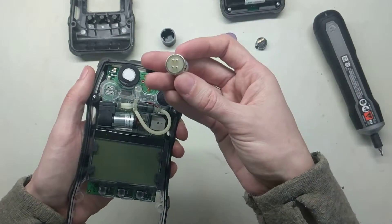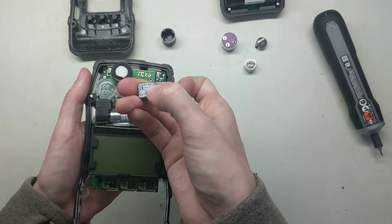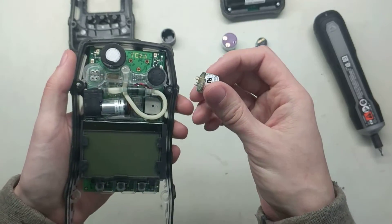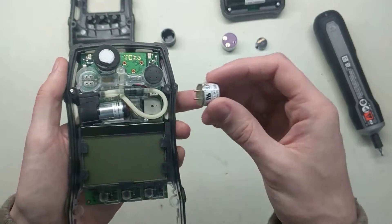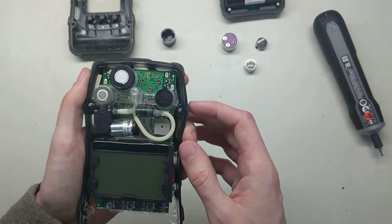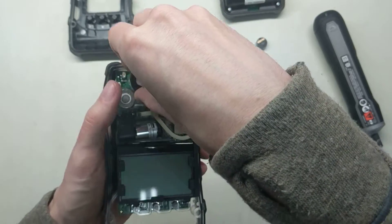LEL is the same thing — swap it out with the other one. The three-digit code on this one is right here, and that's going to tell you the first two digits are the month and the third one is the year. Now when you're reinstalling this sensor, look for this notch here — you want to make sure that notch faces up, with the gold pins on top. We get a lot of calls about people who install their new LEL sensor and it's reading negative. Usually that's because the notch is on the bottom and it's reading exactly the opposite of what it should. So make sure you install that correctly.